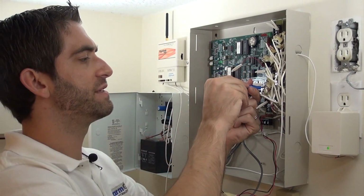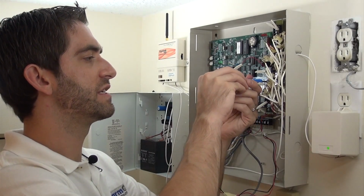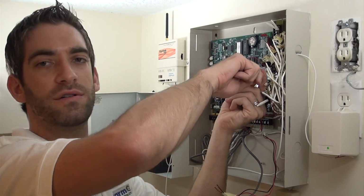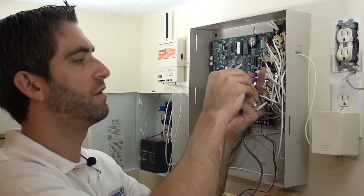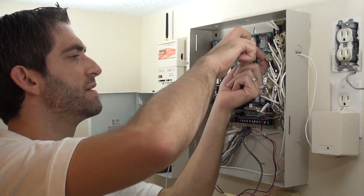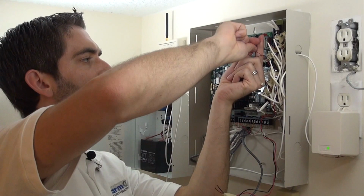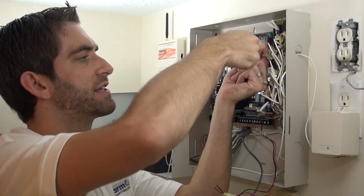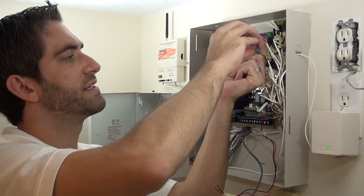And like I said before, this panel is broken out into 14 different zones. This is a split level or 2-level house, upstairs, downstairs. So it's a mixture of windows and doors in the bedrooms and the front door, garage door areas. And we'll go through each of those zones as we add them back. Some of these zones are spliced in. A couple of different loops are spliced together, which is the cause of some of this nest. And we've got them tagged so we can see what's connected, and we'll go through and point out each of that as we add the new zones back to the VISTA.